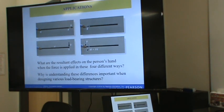Now if someone holds one end while I apply force out here versus closer in - does that feel the same? The first one was more difficult to handle, wasn't it? So if I want the same twisting effect when the force is closer in, I've got to apply more load. Or maybe a load and a moment. I could also twist on it and have the same effect as having a load farther out on the stick.